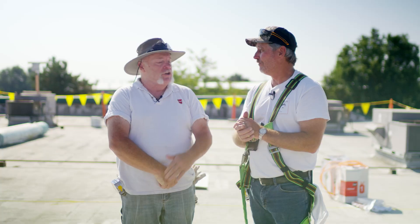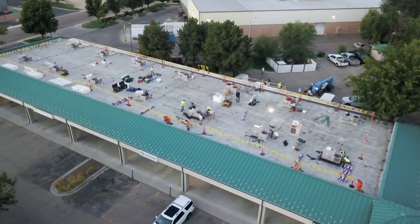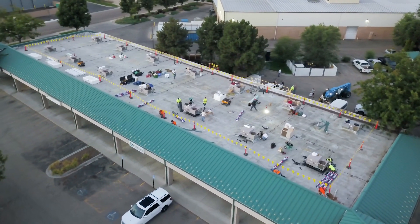So the steps to preparing your roof — whether it's a single ply, a built-up smooth or gravel, or a mod bit smooth — you're going to go through the same steps of getting rid of equipment you don't need. Every step is going to be the same, but you have to consider what you're going to recover with. Over existing built-up, we need at least one inch for TPO, inch and a half for PVC. What about a coal tar pitch roof? Same thing — we cannot go direct to coal tar; you have to have insulation on that for sure. We got rid of all the dead equipment and anything we don't need. Stay tuned for our next section where we're actually going to start installing the roof.